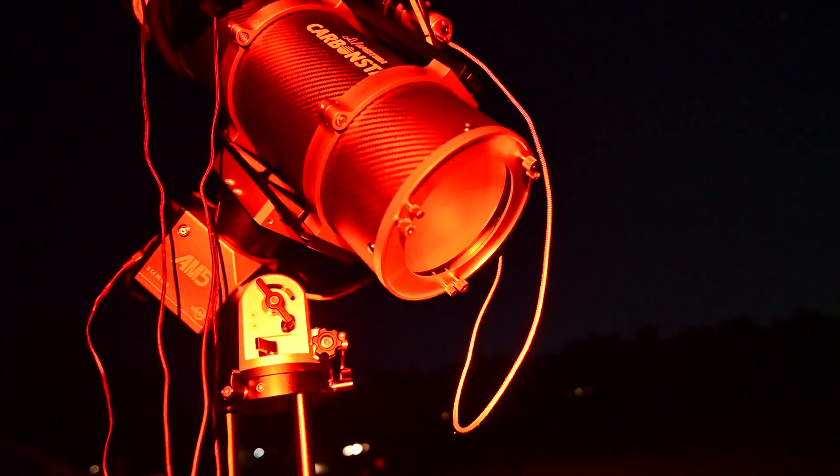This part is made of flexible filament. The factory cap is made out of hard plastic. The problem with this is in cold weather, when the metal shrinks, this thing just kind of falls out. The way it holds itself in place is by creating tension on the primary mirror — on the inside of the primary mirror holder.